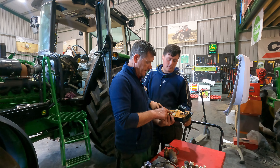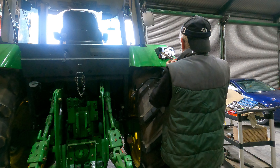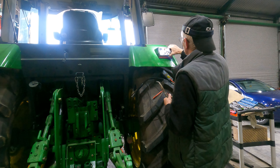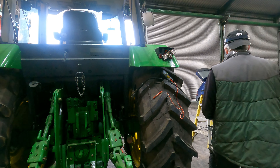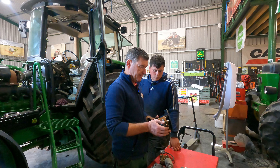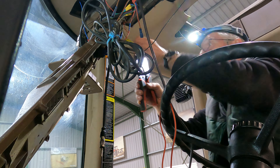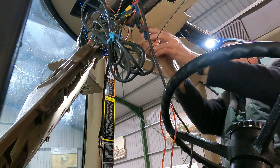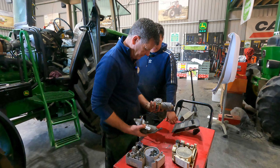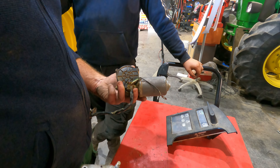I think we have issues there with the wiring going down, the multi-plug coming down — power not getting down to these instruments, because some of them are working and now there's none of them working. We're going to have to start all over again here, which is not ideal. We'll bring in the 3350 as a marker just to see — it's a good reference. We have a few wiper boards here that were in the cab; not quite sure which belongs between the two tractors. I was trying to get one of them working just quickly to eliminate if there was something wrong with the tractor side.